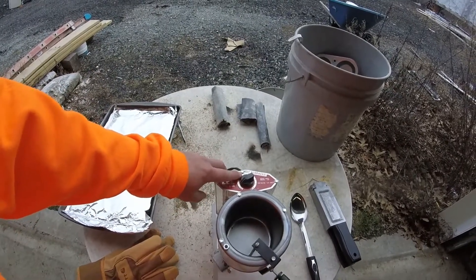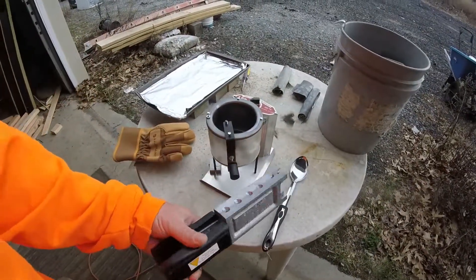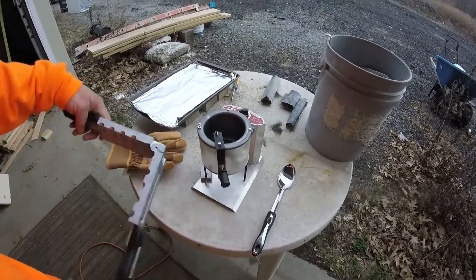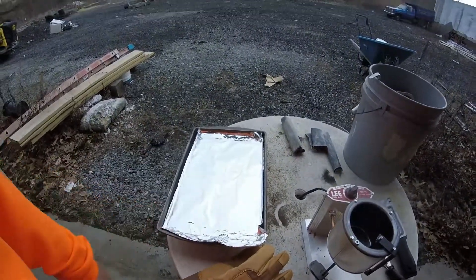From the research I've done, for bank sinkers about five or six on the setting. I've got my Do-It mold — it's our three-ounce sinker, makes four with a clip. That's what we normally use to do a lot of fishing in the river for striper, porgy, blackfish, flounder, whatever's in there. It's close to me so I don't go out too far, so the three-ounce bank sinker works out rather well. Then we've got our tray to knock them off on, with some blocks underneath to keep the heat out.